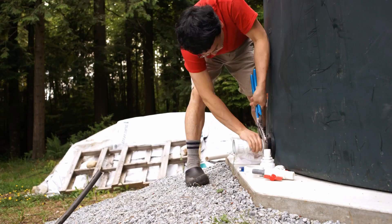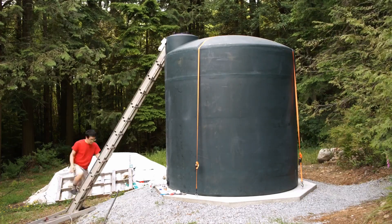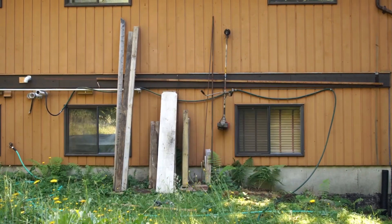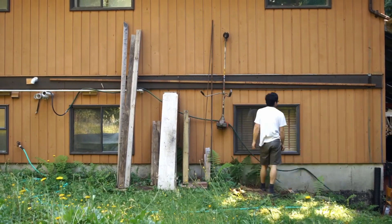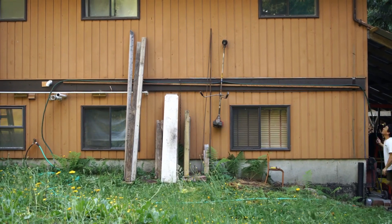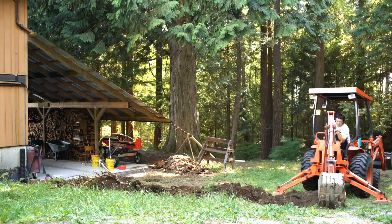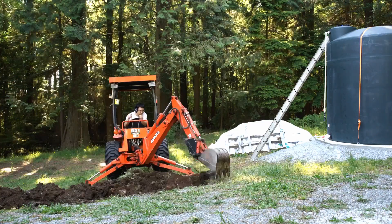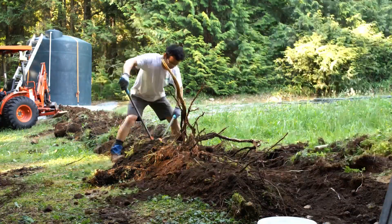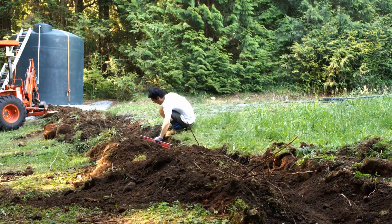I am ready to connect everything I made. I make the hole support with a few strips of wood at a gentle slope following a chalk line — this slope will help me drain the pipes in winter. I need to dig a trench to bury the pipes so I can still drive over this area. There are quite a few roots in my way from the big cedar tree, so I cut them with a shear. I also check the entire run with my level so that no water will pool in any low spots when draining the system.